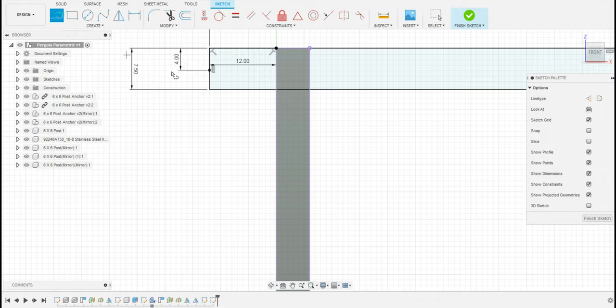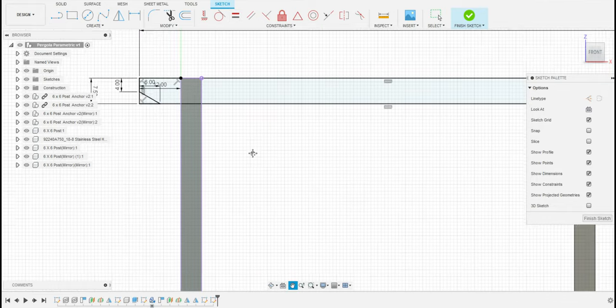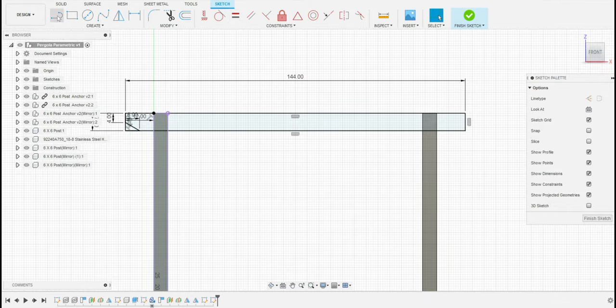You probably want to paint it, to be honest, whereas the cedar, you can just treat it and call it a day, and it looks great in its natural state. But these are all 2x8s, and I'm just cutting in the angles to give you that look that you definitely want on a professional-looking pergola.